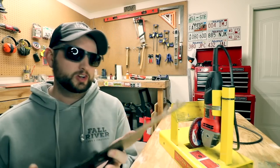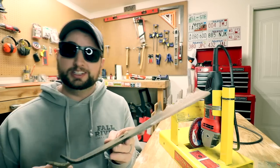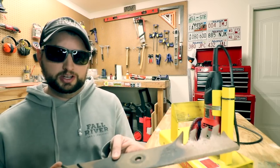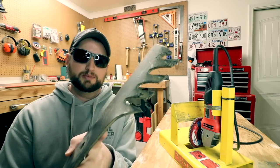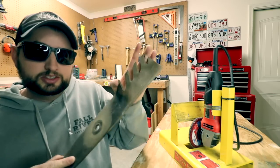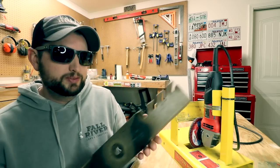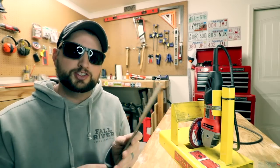This is another blade that does not work on this — a gator blade I found on eBay, off-brand, no-name brand. I ended up really not liking them even though I bought several sets. I used them a little bit, but ended up buying some Oregon blades and switching over. The way the gator teeth are shaped, as you pull it across the guide, it actually causes the blade to twist a little bit and gives you a bad grind on the end of the blade. No matter how many times I tried, I was never able to get it to give a good edge to these blades.